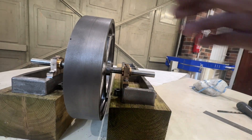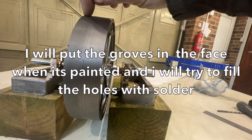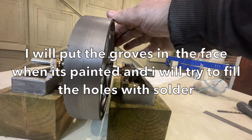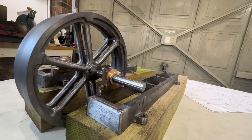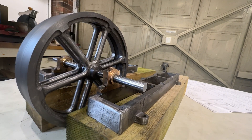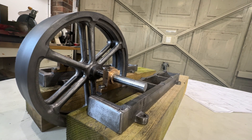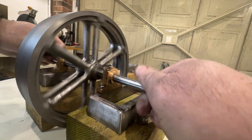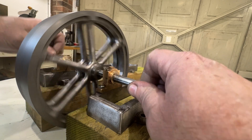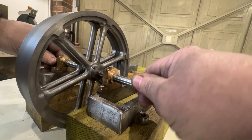The only thing I'm a little bit disappointed about is these blow holes here. I could take some more off the rim — I haven't yet decided. But effectively the video is about slowly machining this, and don't underestimate the fettling that's required — just cleaning these spokes and everything else. I didn't show any of that, but I looked like I'd been down a coal mine once I'd finished. Nothing wrong with that though — it spins nicely, and it moves on the rods as well. Enjoy the video and don't forget to like and subscribe.